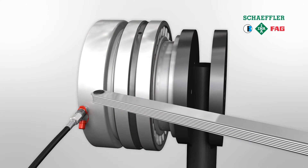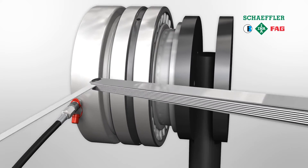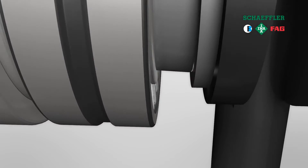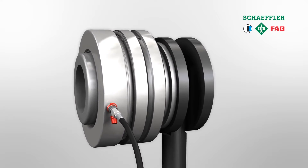Now you're ready to start hand pumping. You know you have reached the desired position by simply measuring the radial internal clearance of the bearing. As you are pumping, you want to make sure that you go just a little at a time and then rotate the nut every so often so you don't overextend your piston and blow the seal. We've done that in previous videos because clearance is so important — it can't be too tight, can't be too loose.